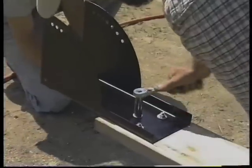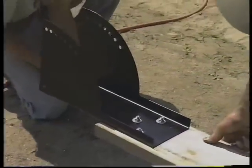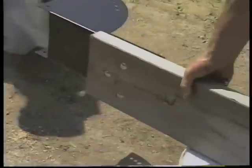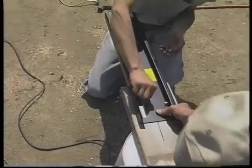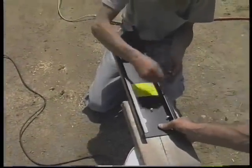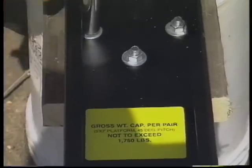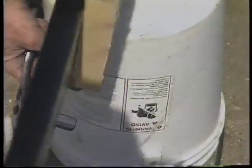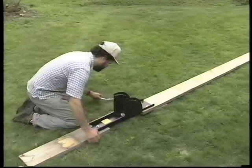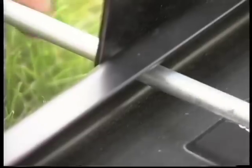The nuts are tightened until the carriage bolt heads are countersunk into the wood and therefore will not protrude when they are later placed on the roof. The straight ridge hook bracket is then attached to a second length of 2x8 using the same method. Ultimate ridge hooks have been tested to withstand more than enough weight for a typical chimney setup. The 2 ridge hook halves are then connected.